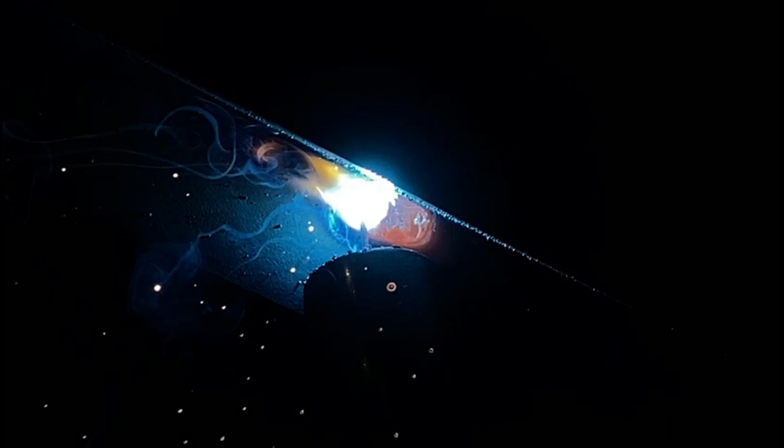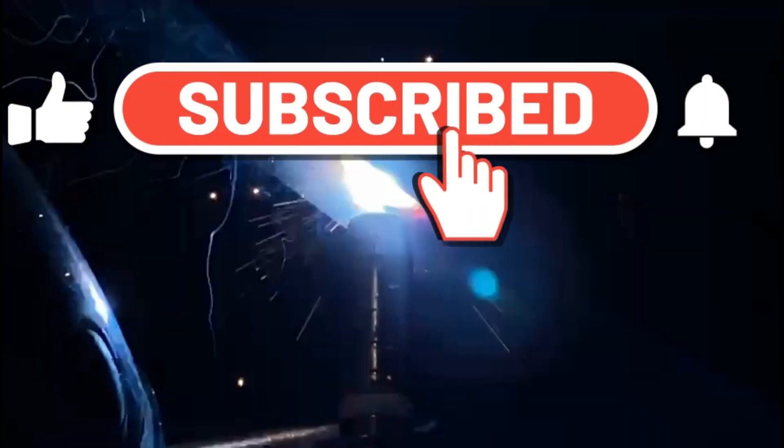The aim with this run is obviously trying to keep the leg lengths on each plate the same, and fusing into the run before. As you can see from this shot, the amount of heat that we're actually putting into the plate is quite high, which you have to be careful of — this is only 5mm thick. So if we overheat it, the potential is we're going to put a hole into that.